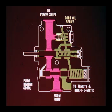In the event that a pressure rise should occur in the transmission supply gallery faster than the flow divider spool could sense and react to regulate the pressure, the transmission circuit high pressure secondary relief valve would open. The pressure setting of this valve is approximately 250 psi. The relief action of this valve would normally occur in the instance of a cold oil start, and for this reason it is described as a cold oil relief valve.